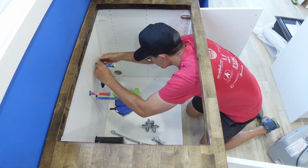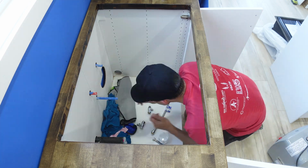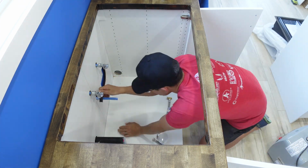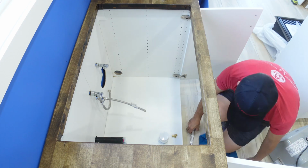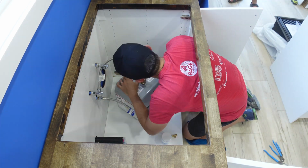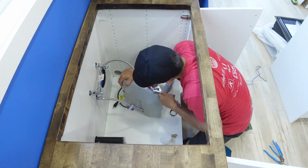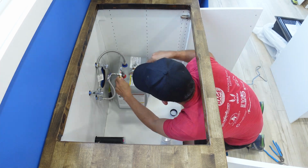The water line coming into the studio from the well is just cold water. So I have to make hot water once it gets in here, and obviously this isn't a very big space, so I can't put a full-size water heater in here. So I found a small one from GE that holds 2.5 gallons. I just had to tee it off a couple of times in order to have enough connections to hook up all the stuff that needs hot water. In my case, it's 3 connections. I need one for the dishwasher, one for the sink, and one for my pot filler over the induction cooktop.